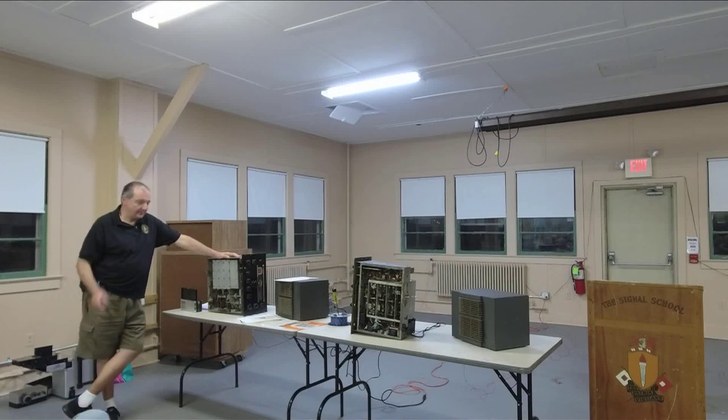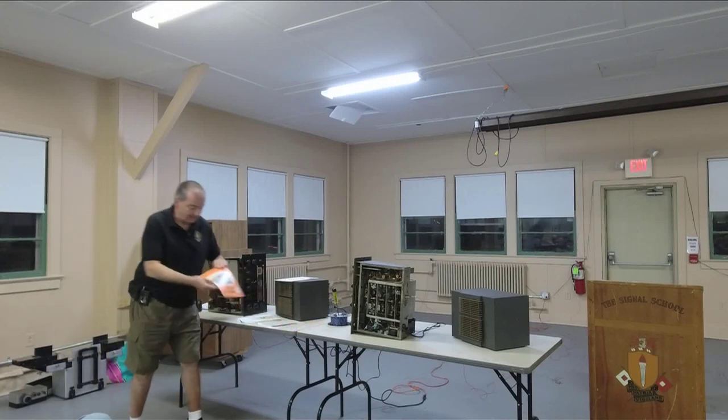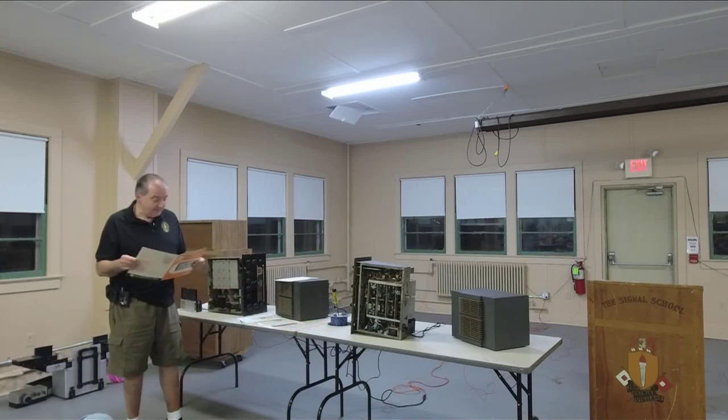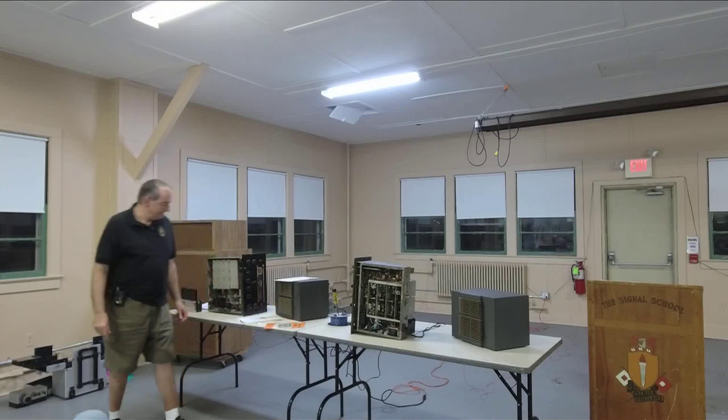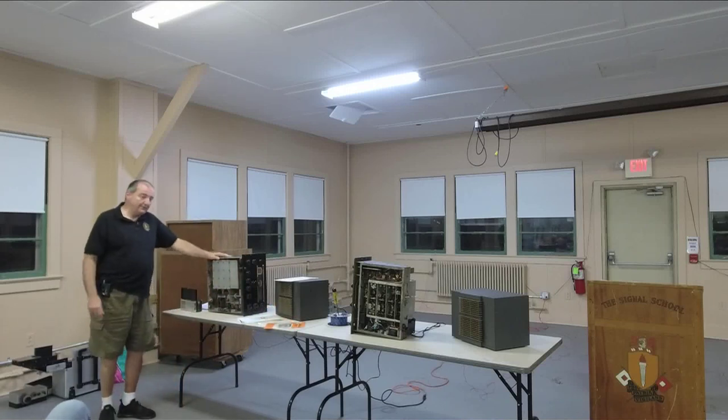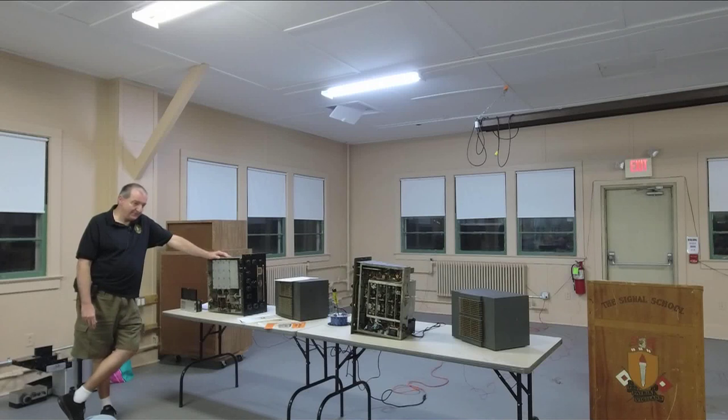Just the Canadians, but they wanted to go from 75 kilohertz to 500 and about 450, whatever it was, and then they wanted to jump. In fact, this CR91, I think, is the same thing. And so they skipped most of the AM broadcast band: 75 to 550, and then 1.5 to 30. I think that's approximately what the AR88LF does. And that's fine, unless you want to do our DX contest, and then it kind of screws it.